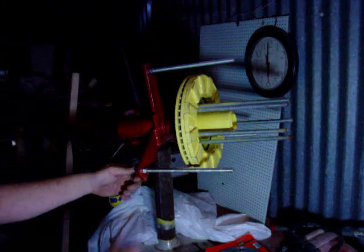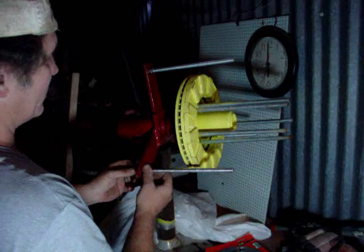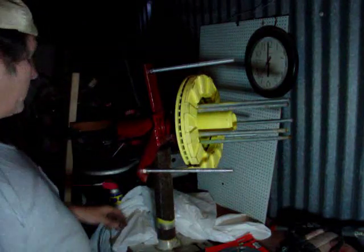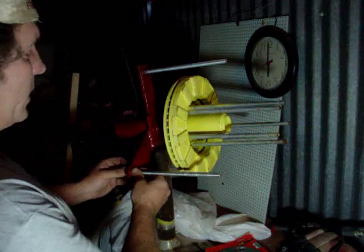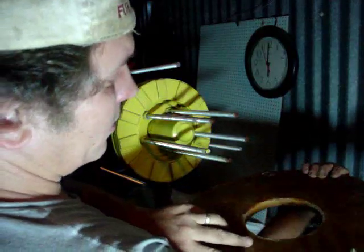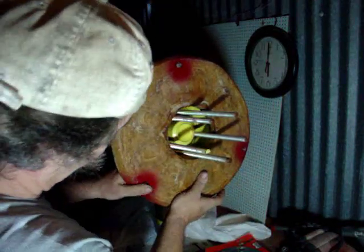I got all the nuts all shined up. I put one on here and slid it in — I left the beveled side out. Remember, I beveled all of these. Clean these up, chase the threads. Before you tighten them completely, what you need to do is put this on the way it's going to go. The three terminals on each side going on here, and give it a test fit.